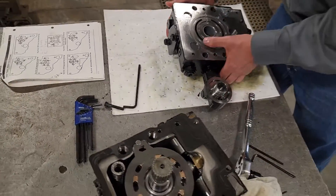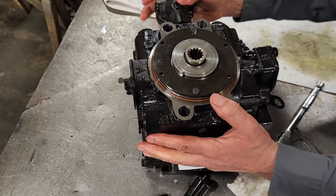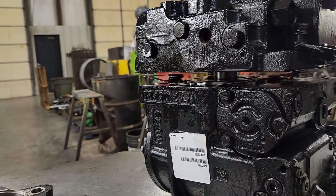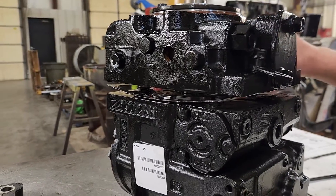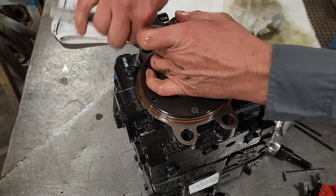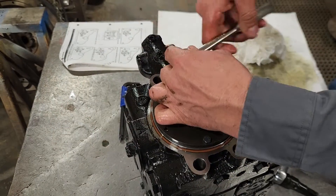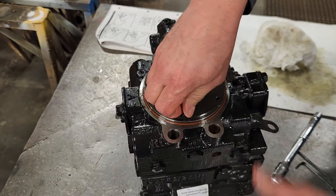I'm going to reposition this back over the top of this half. I like to look down inside and make sure that my valve plate is sitting on those dowel pins and is not going to move. This particular table has a hole cut in it for the shaft to stick through, and I can reach up in there and turn that shaft to help line everything up. If I'm having trouble lining that up, my next step is to carefully take the retainer plate off the charge pump, which will allow it to fall, and then I have to line everything up piece by piece — sometimes easy, sometimes troublesome.